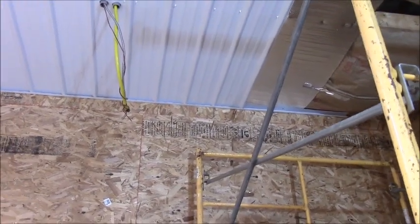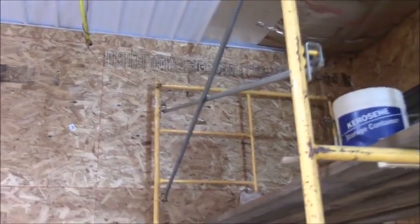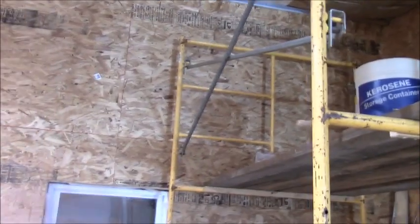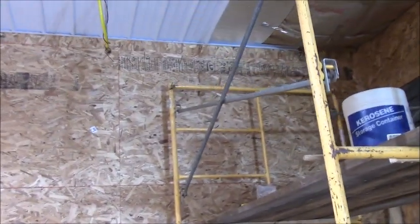I'm gonna put the furnace up first and measure because the flue has to run uphill a little bit. Then you gotta cut some slightly bigger than 6-inch holes, and the thimble kind of comes in from both sides, and it's an air gap thimble, and this is double wall flue pipe, so it won't get real hot. It'll just get warm.